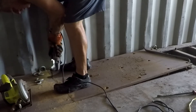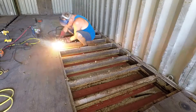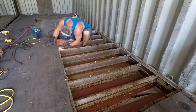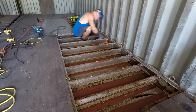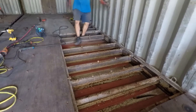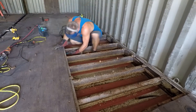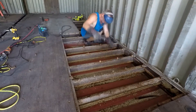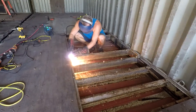A little more cutting with the corner saw and then a piece of wood came out - I didn't cut all the way through because I didn't want to hit any metal down there. Here I am cutting the main supports underneath the container out. These are going to have some kind of a header, probably a u-channel that runs parallel to the wall since all these supports get cut out - that's for the stairway. So again, roughly 12 feet by 4 feet wide. Behind me there's the metal plate with internal structure and a very solid cross piece - not just a u-channel, it's a big honking thing. You'll see me cutting through that in a bit.